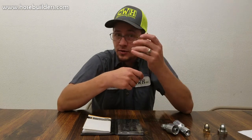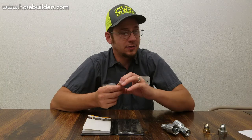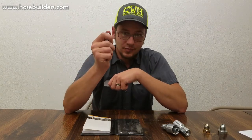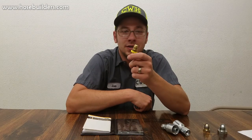SAE 45-degree flare fittings also come in sizes 2, 3, 4, 5, 6, 8, 10, 12, and 16 — but sizes 6 and 12 have a different thread size. People commonly say 'this is a 3/8 flare fitting,' but a 3/8 SAE flare is 45-degree, while a number 6 JIC or 3/8 JIC flare fitting is slightly smaller, so the two won't go together. I've had people call it a 'number 7 JIC,' which doesn't exist — this is a very common one to get confused.